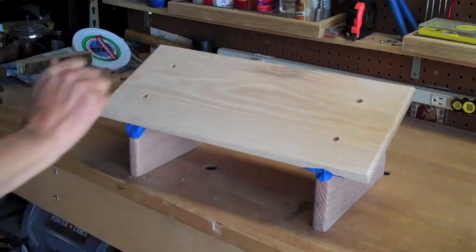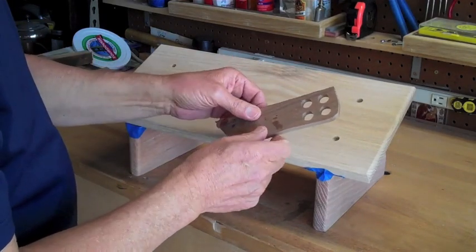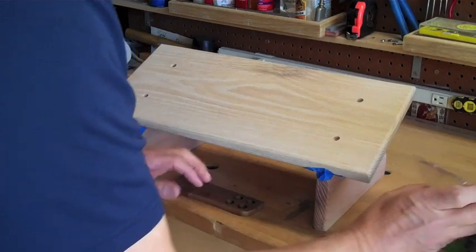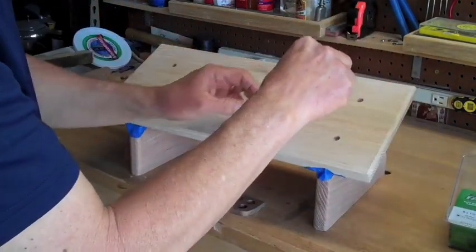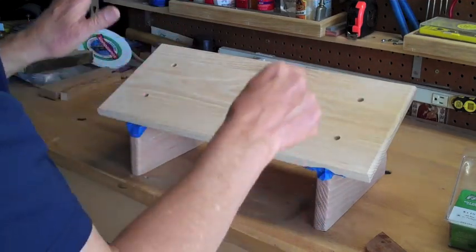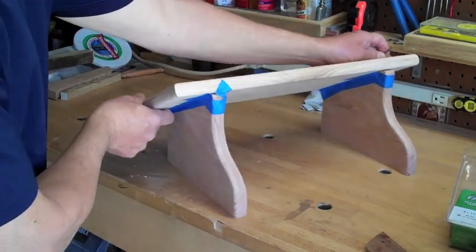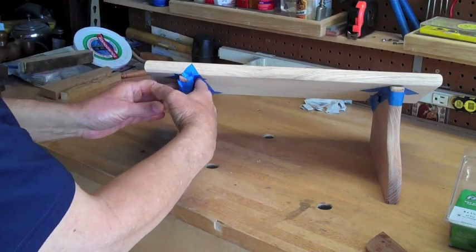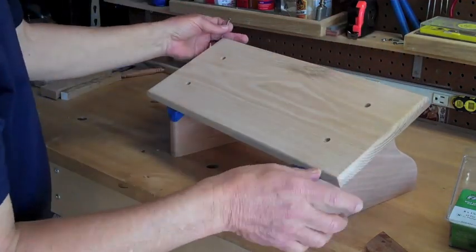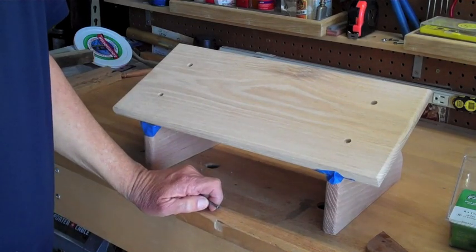I now have my foot stand in place with these pre-sunk holes. I'm going to cut some wooden plugs that will fit into these holes and plug over the screws. I've drilled generous pilot holes so I can put the screws in — I'm going to screw it and glue it. I didn't know how to line things up at an angle and drill 90 degrees, so I lined everything up, got it perfectly squared, and blue-taped it together to hold it in place for drilling the pilot holes. For those of you woodworkers out there who have a better way to do this, maybe you can tell me in the comments.